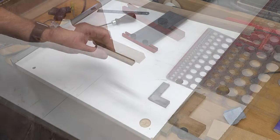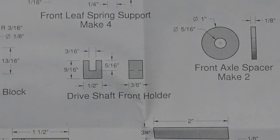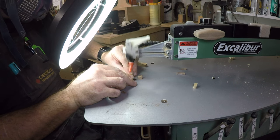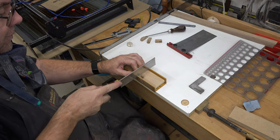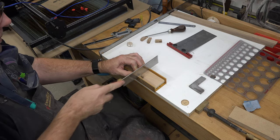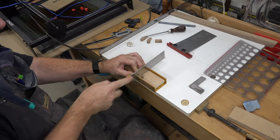We're moving on to the last piece: the drive shaft front holder. Mark the dado on the half inch side — five-sixteenths of an inch deep and three-sixteenths wide. Take it over to the scroll saw and cut that dado out. Normally I'd cut it to its nine-sixteenth final length at the table saw using the small parts cutting jig, but using a miter box works just as well.